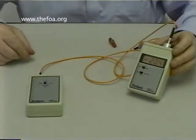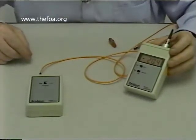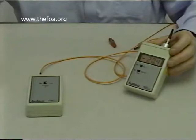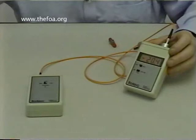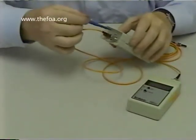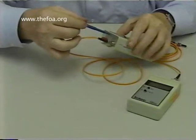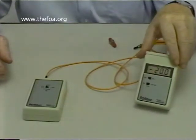If I'm going to measure loss, my numbers are going to get bigger. Minus 20.4, now minus 20.5 as the source warms up — minus 20.5 would be a tenth of a dB less power; minus 21.4 would be a dB less power. So as the numbers get bigger, I have loss. I can subtract numbers to measure loss, or simpler with a FOTEC source: I can use the adjustment on the end panel to set my output at a precise value. After my source warms up, I set my value to minus 20.0 dBm.